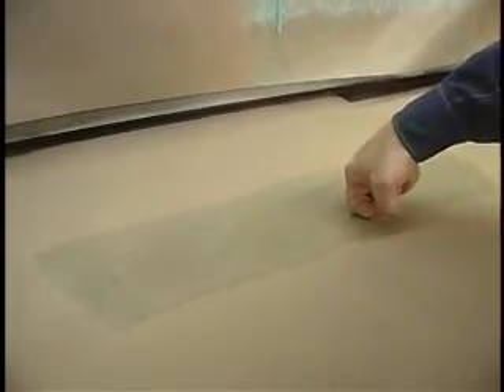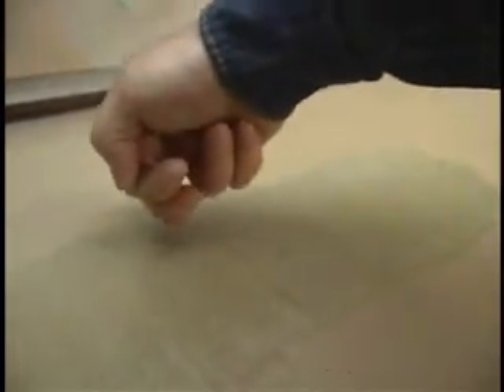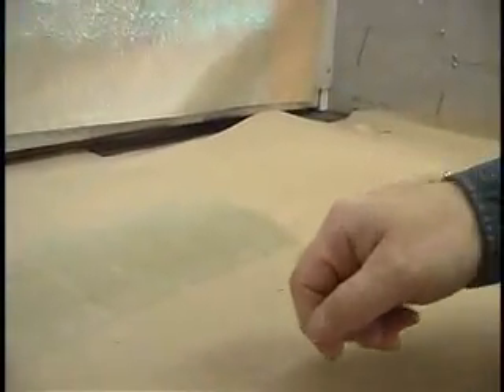We want to understand dry times — people want to make bonds immediately. These new adhesives are wonderfully fast; usually about a minute is all we need to wait before we can make a bond. Simplest way — same as with the aerosols — we simply test with our knuckle. You can see that's still wet — that's a little too fast, so we have to wait about a minute. Keep checking with your knuckle. If you keep tapping with a wet knuckle, that's not going to be good, so you're going to want to change your knuckles or wash your hands. After about a minute, you can see how aggressively tacky that is — we're ready to go. It's very important to remember open times for successful bonding.